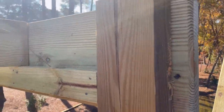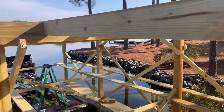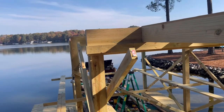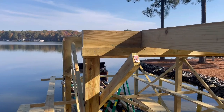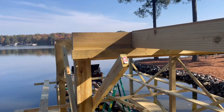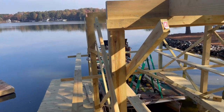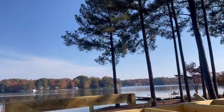On the outside I don't have a joist here; what I'm going to do is put a two-by-twelve as a rim joist around the outside, and then the decking will come on top of that. This is just an inexpensive boathouse, so we're not doing a skirt board or anything fancy — the decking is just going to overhang with a small reveal, or be flush, and just have a railing on top. The stairway will be coming up through the deck area and turning into the upper deck.